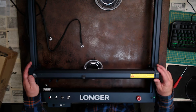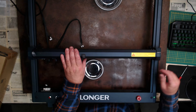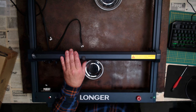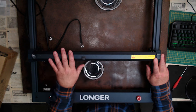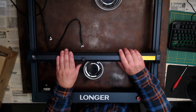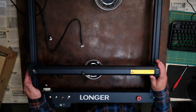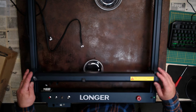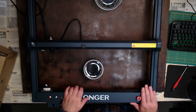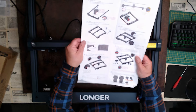It wasn't very easy to move this part of the rail backwards and forwards — it was all grindy. Also on the RAISE 5, this side wasn't aligned properly — it was a little bit tight on the rollers. That was easy to adjust, but the X-axis was a nightmare because there wasn't much adjustment in it. When you adjusted it, you cranked the pulleys, meaning one edge was touching and the other wasn't. But this feels so smooth. I'm impressed and excited about this.